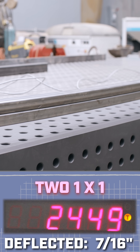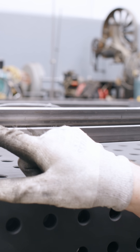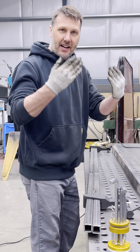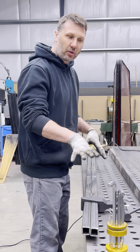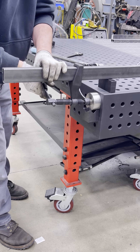Yeah, it's definitely bowed. I think this would be stronger if we put a couple of tack welds on it. So this bar is hot and if I test it right now it might bend, so we're going to let it cool down. In the meantime, let's use the standard one by two bar and see what we can get with that.